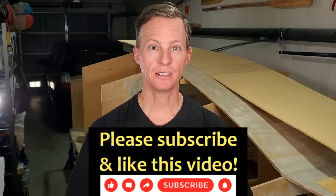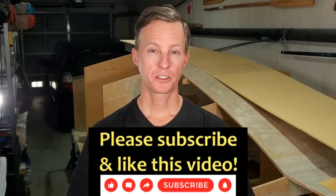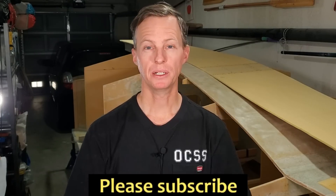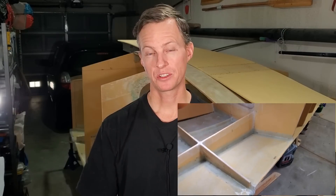In this video, I'm picking up the day after where the last video left off. What I got done in the last video is to build the starboard chine panel of the boat and then attach it with thickened epoxy. I also managed to tab it on with fiberglass from the transom up to frame C5.